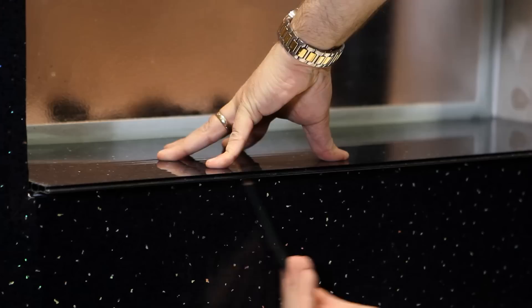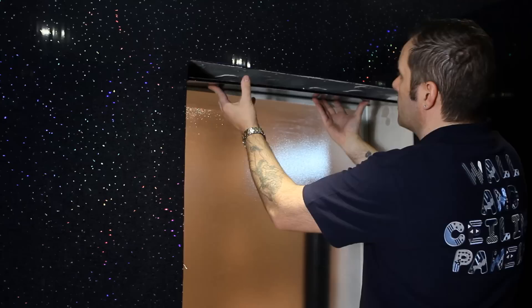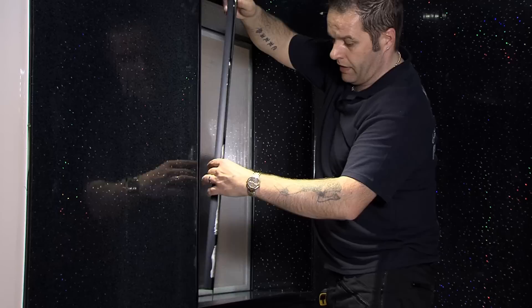For the interior profile of the window, measure the sill and cut a panel to size. Clip an end cap onto the panel to ensure flush fitting. Apply a generous amount of adhesive to hold the panel in position and slot into place. A good idea is to then fit the top piece, as this can be held in place by the side panels whilst the adhesive sets. For a professional finish, attach these external angles, which are available in a number of colours to suit your room.